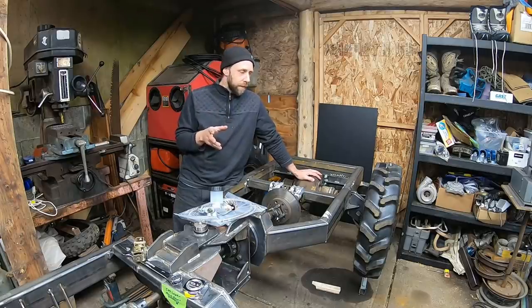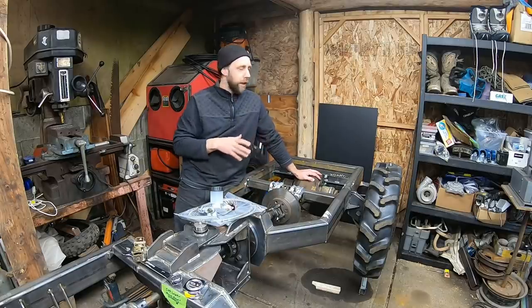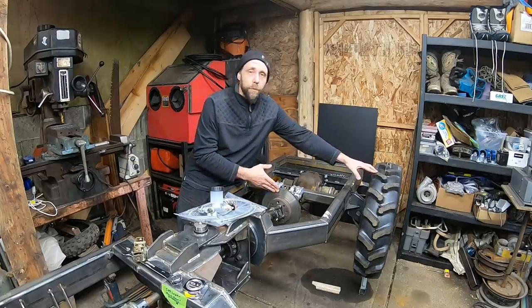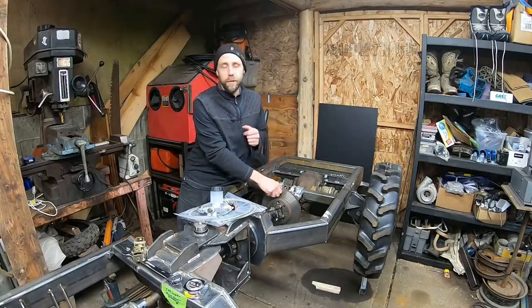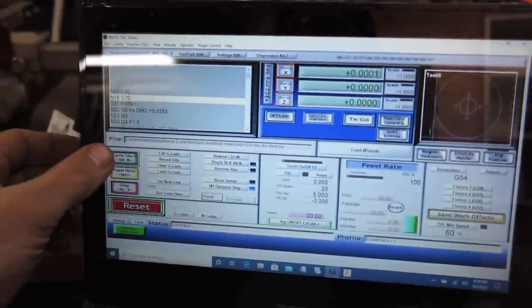One thing you guys may or may not know is going through this rear differential is about a 4-to-1 gear ratio change. When you got a disc brake or a drum brake out here spinning that wheel, that's a 1-to-1. So if it takes 100 foot-pounds of pressure to stop this thing, grabbing it on this rear disc right here, with a 4-to-1 gear ratio, it would take 25 pounds to stop that wheel. Hope that makes sense to you guys. All right, let's go cut out some parts.